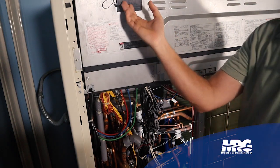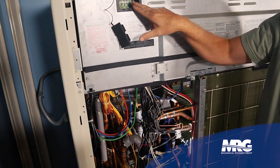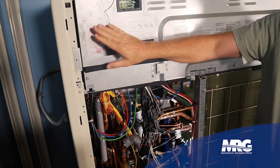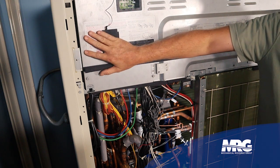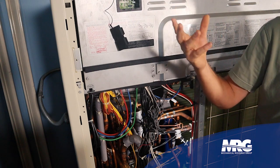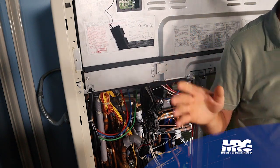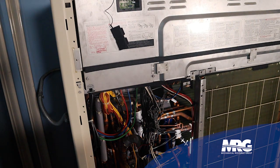Once we find out how many there are, we come to this unit. By opening this little window here, it exposes the printed circuit board, and there are a few buttons. By manipulating those buttons, I can scroll through and this condenser will tell me what it's talking to. If I've got 10 indoor units and 5 branch selector boxes, it will display that — and now I know I'm ready to move on to the next step, which is running it through test operation mode.